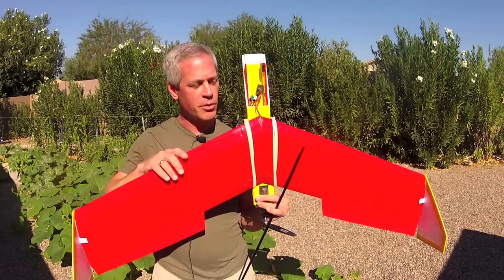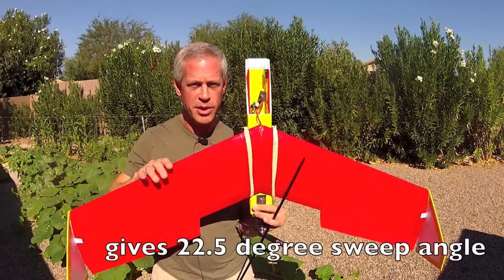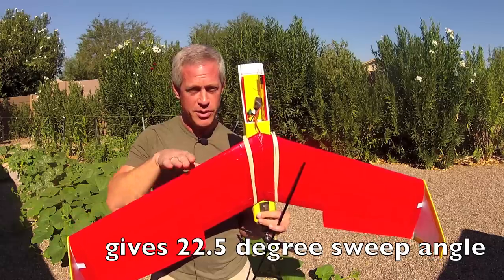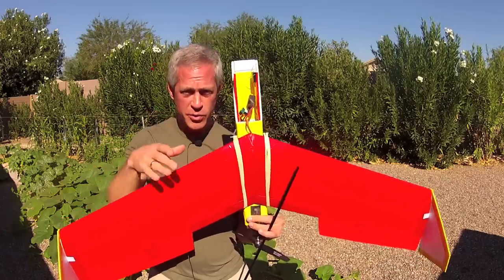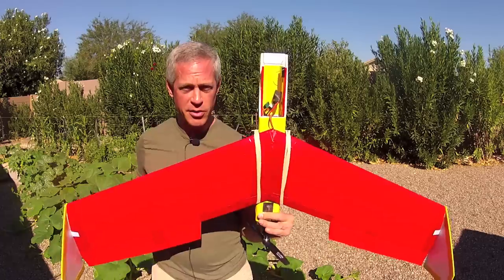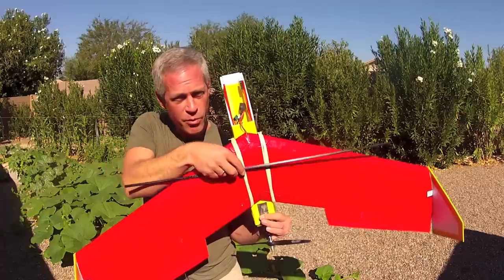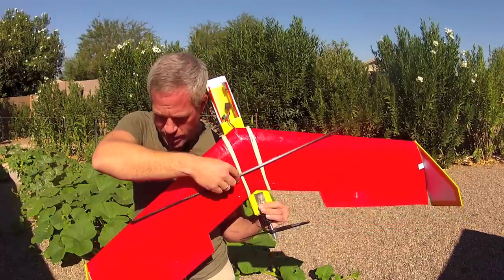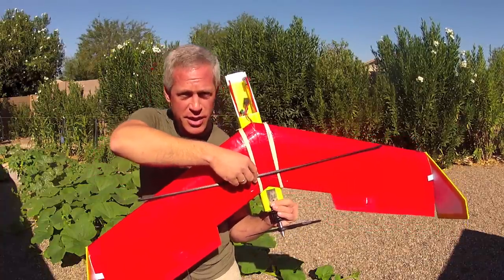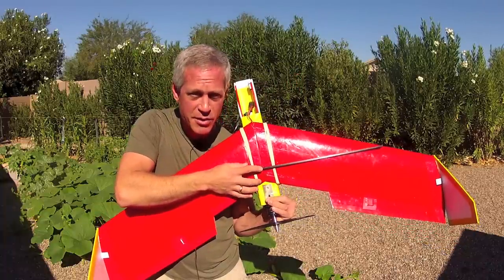I chose this particular wing planform with a 135-degree nose angle, which is a good mix of efficiency — which increases with a more straight-across wing — and stability, which increases with greater sweep. This sweep configuration maximizes the amount of wing and the usage of a single 32-inch aero shaft, which fits across from leading edge to leading edge almost directly at the center of gravity.